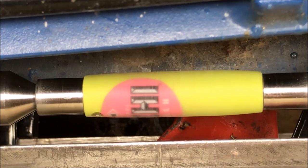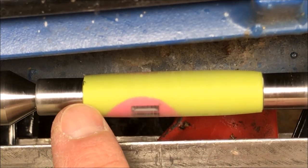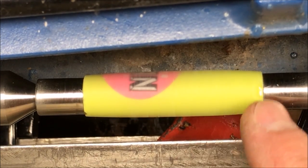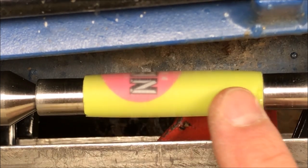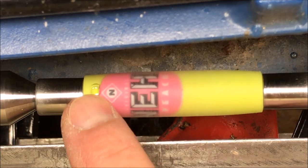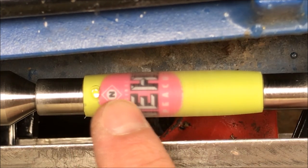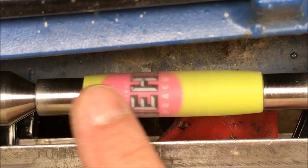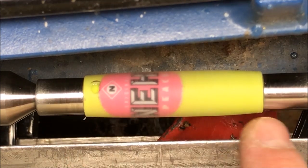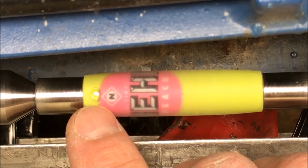Here's a quick peek at the blank as you look at it — take a look at the ends where the bubbles were. There's one right there but I've still got maybe a sixteenth of an inch to turn away, so I think that one's going to disappear. I want to address this one at the top of the knee high sign — it looks like it might have been a little bubble underneath the label that worked its way up. I'm going to blow some air in there to clean any debris out, then fill it with medium CA, hit it with some activator, and continue turning. It's so deep I can actually see the edge of the bottle cap in there.